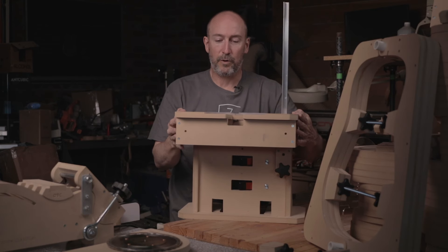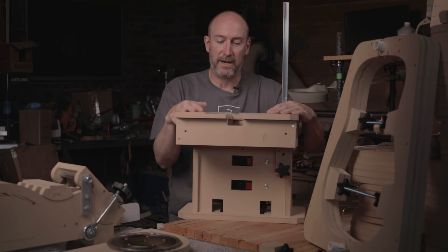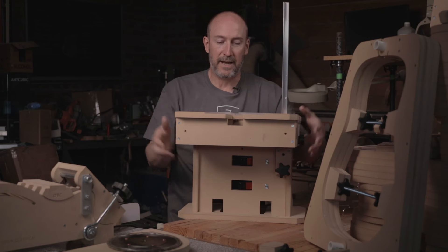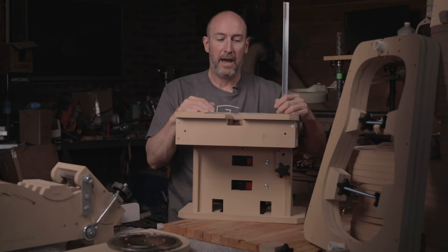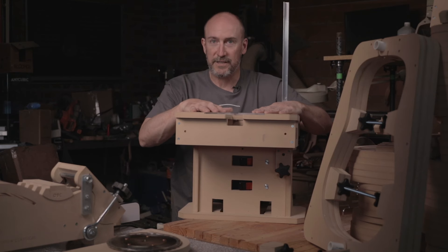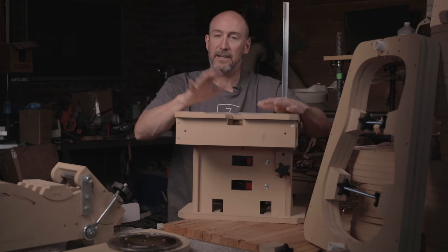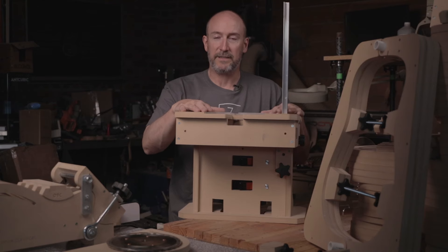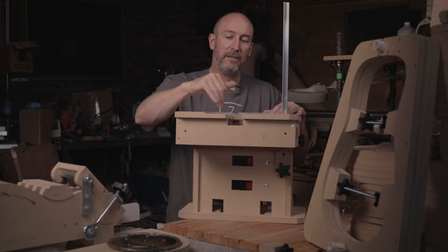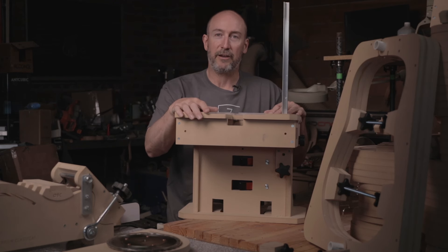What that does is the neck references off of a face that's parallel with this surface — so the angle will be the same exact angle you need from your body to your bridge, and also from the face of your neck to this tenon. This side of the guitar is for putting the mortise into the neck block — it's just a straight mortise that goes right into the body. You can adjust this template in and out to adjust the depth of that mortise pocket. We're going to have different templates for using a pattern-type bearing bit on the router, a collar system, and also for dovetails — so you'll have mortise-and-tenon and dovetail versions with both pattern bits and a collar set. We're also adding dust mitigation: shields and a port on the side of the jig to hook up your dust vac.